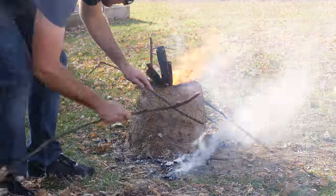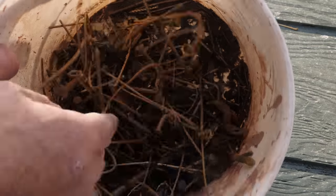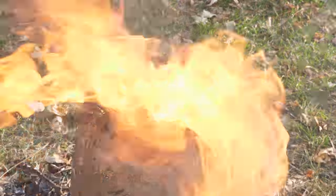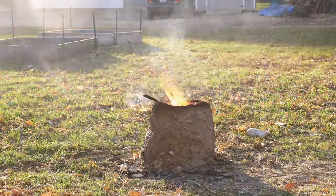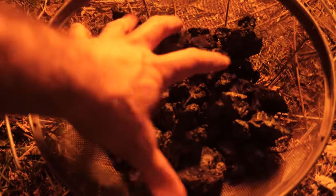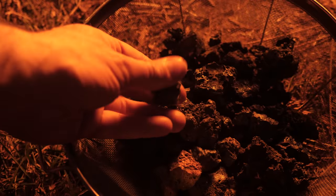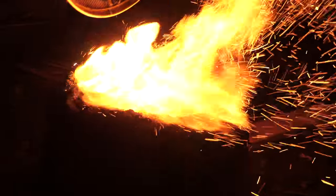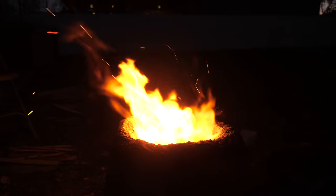Since I have made iron at this point, I'm also going to mix in a collection of scrap iron to help add a little extra volume to our bloom. After doing a preheat the night before, adding all the scrap metal, and then later all the actual bloom and scraps we've had so far from our other attempts, I ran it for all of the next day. The end result is a new bloom that should hopefully be a little bit more successful and a little bit more consolidated.